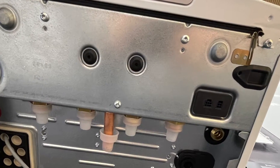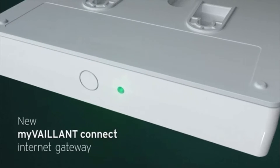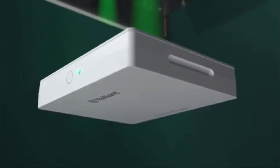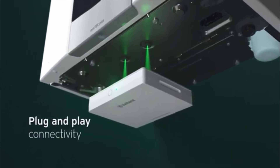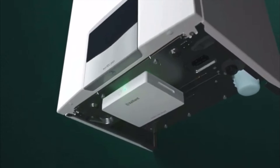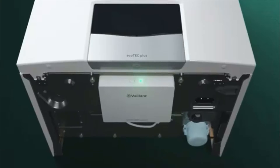You can see two black circles which are securing pegs for the new controls, and there is also a plug socket for these controls. This is the Vaillant Connect internet gateway system which basically just plugs underneath the boiler on these two pins, with a fly lead going from the internet gateway to the plug. It's a plug-and-play system, allowing the customer to install these controls without taking off the cover of the boiler.